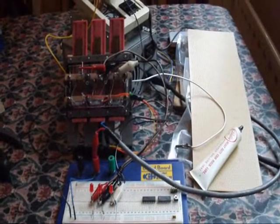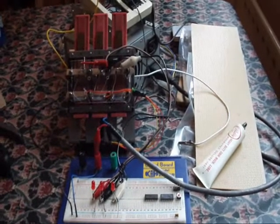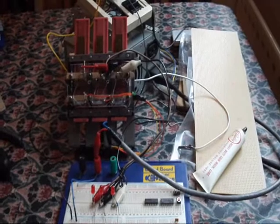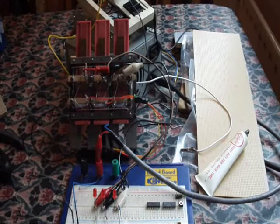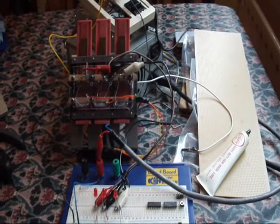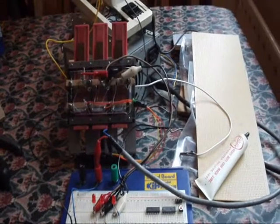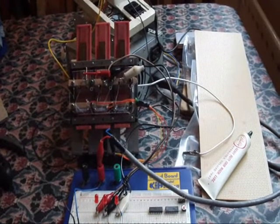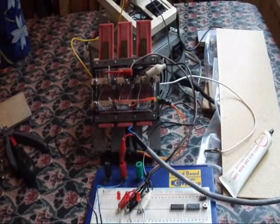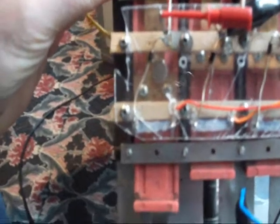Let's see what we're doing in the pinball lab today. I've got a drop target, probably off a Flash or an early Williams game. The interesting thing is there's no mechanical connection between the drop targets and the scoring switches. What I've done is replaced the scoring switches with reed switches, which are magnetic, and then mounted on the back of the targets little tiny magnets.